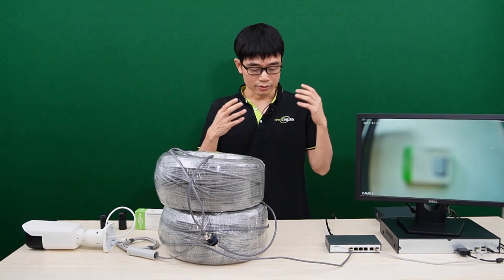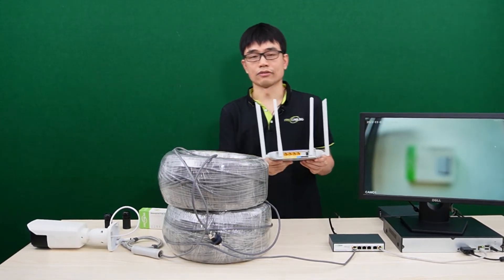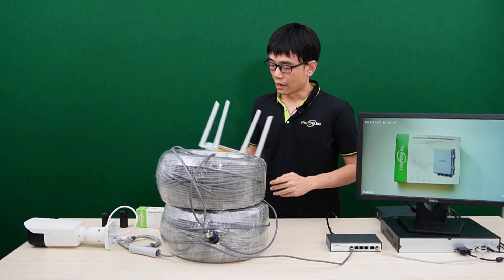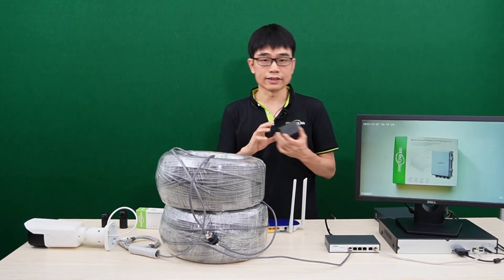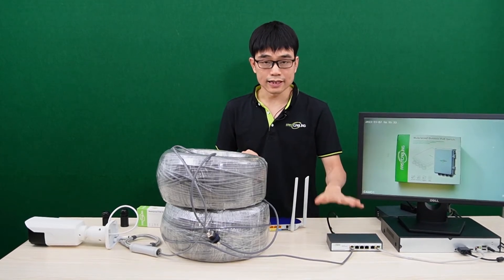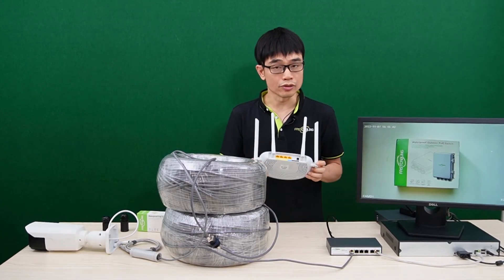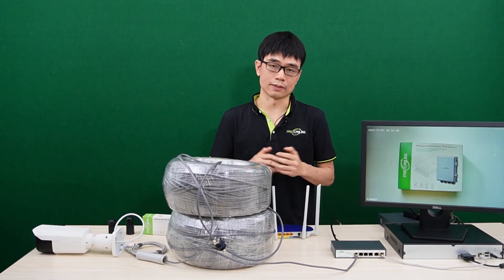Can we also use this system to extend a data-only network, such as a router? The difference is a PoE camera needs both power and data, but a router doesn't need PoE. If we place the router at the end of the cable, it will not work, because we still need to add a PoE adapter at the end. The PoE switch, before it releases power to the edge, needs to classify and verify that the edge device is a PoE-compatible product. Since a router is non-PoE equipment, we need the PoE adapter to satisfy the power handshaking in the PoE system.